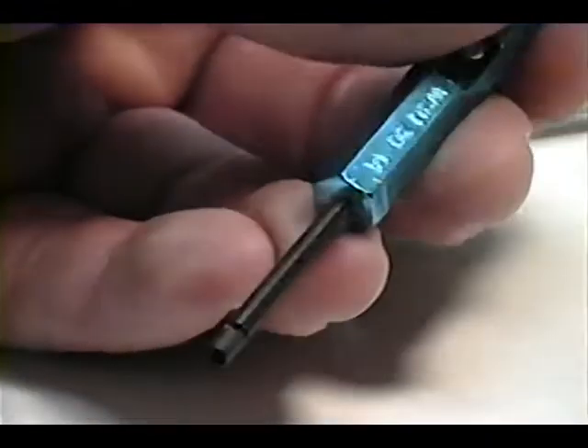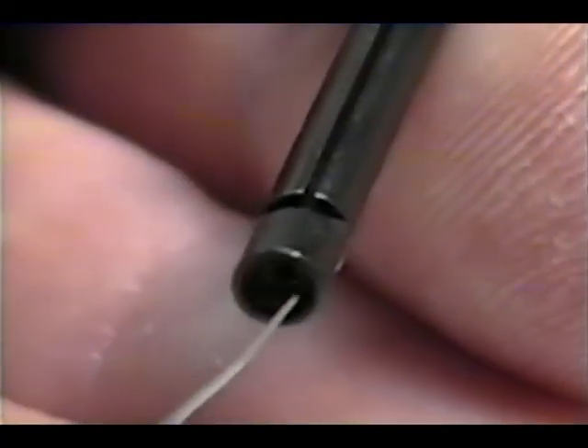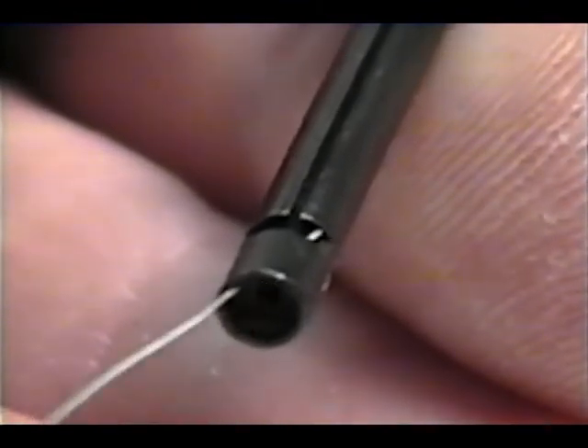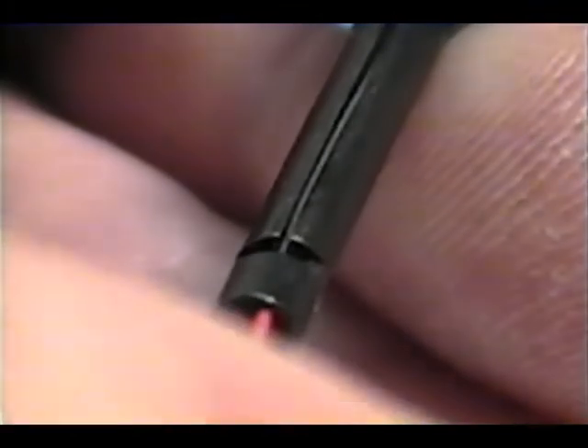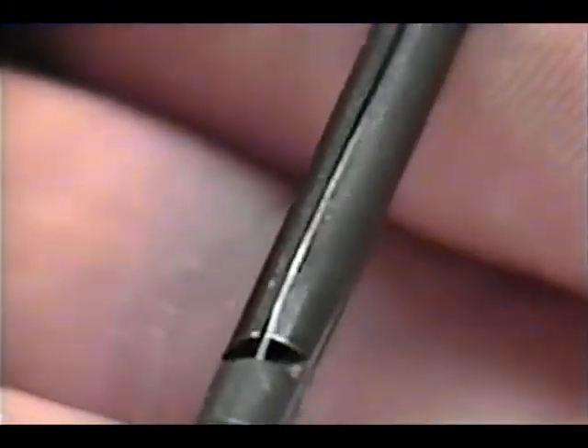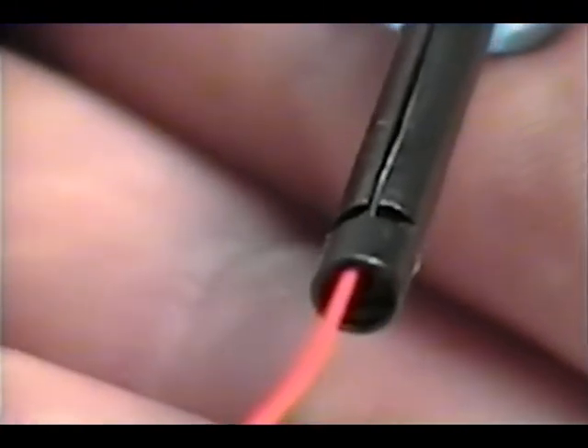In the OK wire wrapping tool, there is a short end for unwrapping and a long end for wrapping, so you have to use the correct side. Only one side has a notched spline in it. Inserting the wire is very similar on both tools — it's inserted into the spline so it fits flat and straight down the tool, allowing you to place the wire onto a wire wrapping pin. The center hole of course is for the pin.